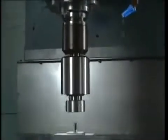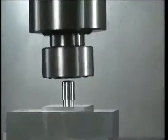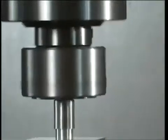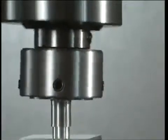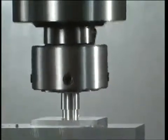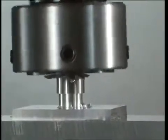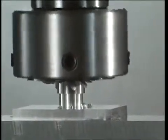The workpiece to be broached is placed on the work center bench, using the holding fixture. The spindle of the work center is started up and the broacher begins turning at between 500 and 1000 rpm. At the instant it comes into contact with the workpiece, the broach stops rotating while the body of the broacher continues to turn.